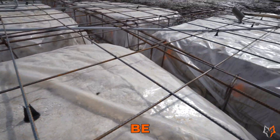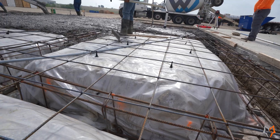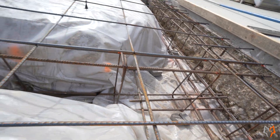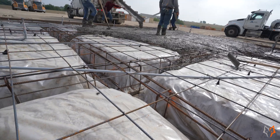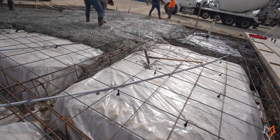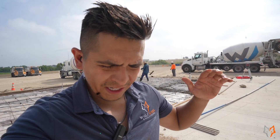We're pouring right now. Got our little chairs — rebar should not be touching the ground. You got the little blocks in there; the rebar should not be touching the ground. If it touches the ground it's no good — it will rust out faster.